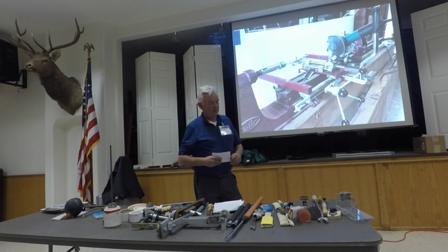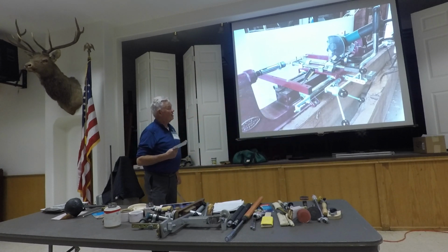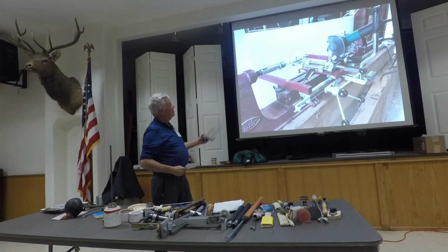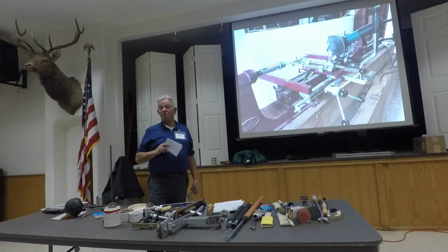There we go. So this is a duplicating jig that I have on an old lathe, and you can see the 4-spindle handle there. That transports the carriage up and down the lathe, and then the handle sticking up in the air by the angle grinder moves the carriage in and out. At the back there you can see a spindle, and the angle grinder has 5 diamond carbide teeth on it. So it's a really good tool for doing balusters and architectural sorts of things.